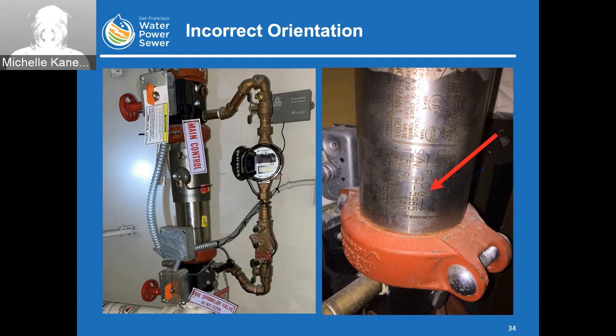Currently, I do not believe that there are any DCDA or RPDA assemblies approved in the vertical down position. So if you see a vertical down assembly in the field, this should send up a red flag to you. And then you could further follow up with the list, but in general, vertical down should not be seen in the field.